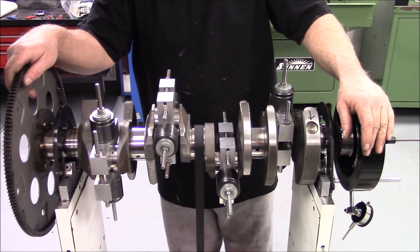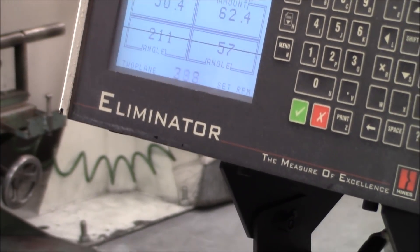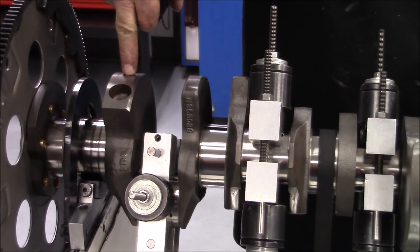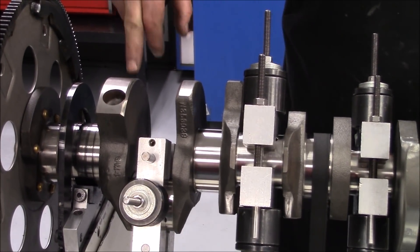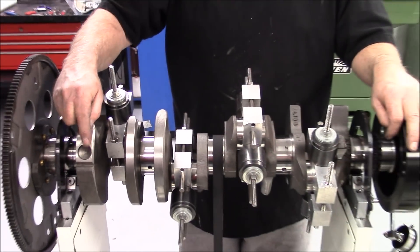Let's go to the back. It wants weight out at angle 57 — that means it wants weight out right here. So what that means, to shift this to the center here, we need to weld this hole up. So that's what we're going to do.